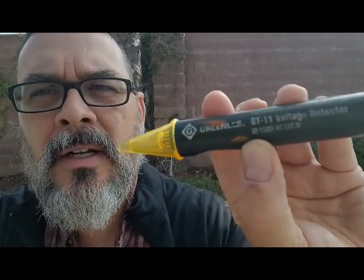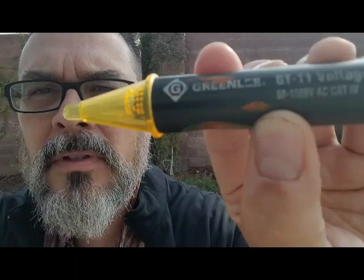This thing tests as low as 50 volts — so it tests from 50 to 1,000 volts. If you're testing something in your house, this might light up and you may think that you're getting a good voltage reading and move on, thinking that the fixture or device is okay — but that's not necessarily true. If you had 50 volts, this thing will still light up. You'd think the circuit's okay, but it's not — 50 volts means you have a problem. You wouldn't know that by using this. So this is just a basic indicator and safety device for a rough idea. You do want to use a multimeter when troubleshooting — it'll give you more information.